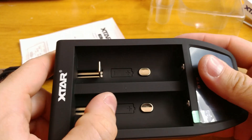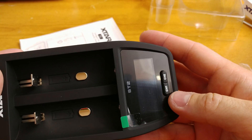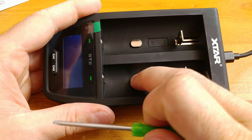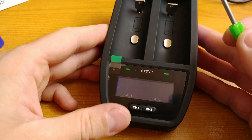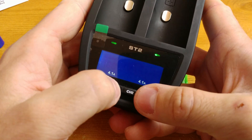Spring mechanism for holding the cells and a USB socket in the back, just like in a regular charger. This is the USB to USB-C charging cable. Metal elements in the battery sockets are temperature sensors. It is a good idea to have separate temperature sensors instead of constantly measuring cell resistance, as this value can be misleading if a cell is damaged — it is simply an extra level of protection.